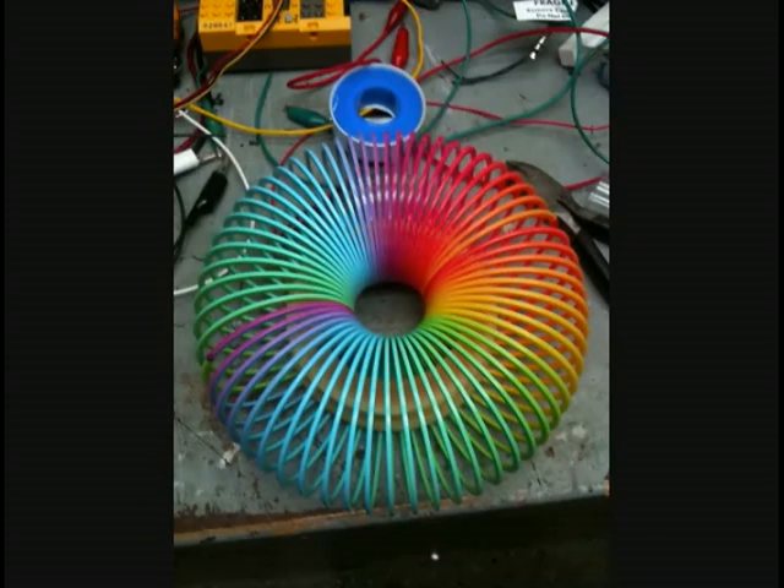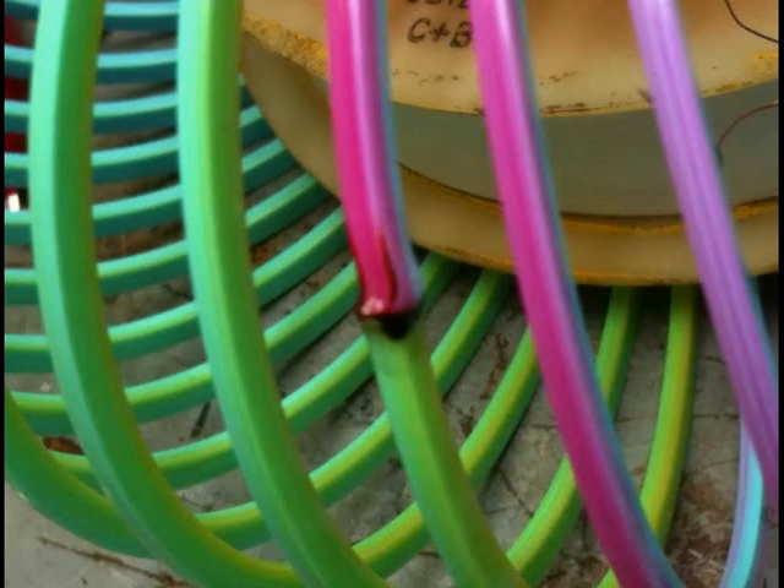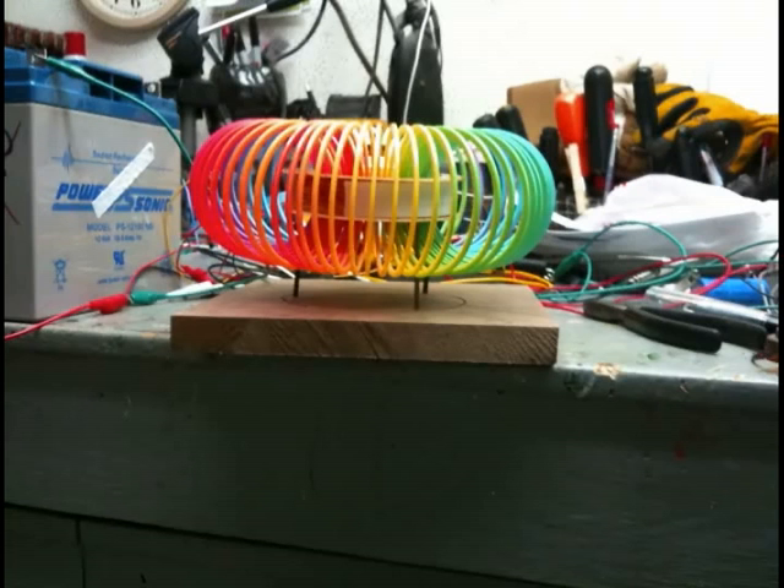In this picture here I got my slinky. My coil is inside of it. There's actually two slinkies here, two junior slinkies. That way there's more surface area to coat and it'll be a little more flat. Here you can see where I've melted the plastic together. It works pretty well — it's pretty tedious but it can be done. Here you can see I made a jig with three nails and a piece of wood. It holds up my coil of wire inside. These are going to be high-voltage toroid wound coils. My coil in there is number 30 gauge, and I slid that in and melted the slinkies together. The jig is just to hold it off the table.